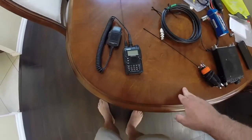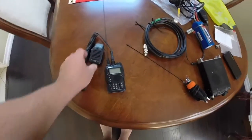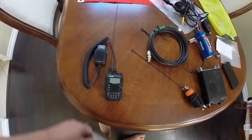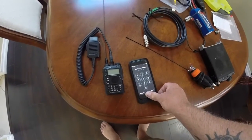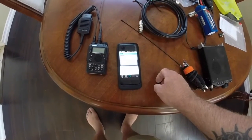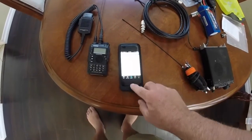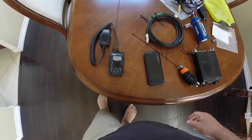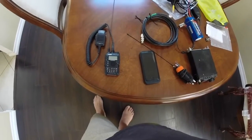A fairly new addition: I always carry an HT, and I put the Yaesu VX8DR in the pack with a little microphone with a GPS antenna. A lot of times in canyons I can't reach my wife, so I run APRS through it. There's an app called Open APRS that I loaded onto her phone — she's a ham too — and all she has to do is search my call sign and she can see exactly where I'm at and track me moving around via APRS. Tomorrow we're going up to the Sierras on a remote 10-pointer hike, so it'll be a real test of the VX8. I'll also be able to send emails and texts to her phone.